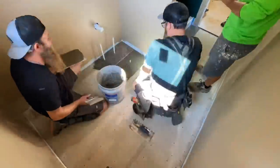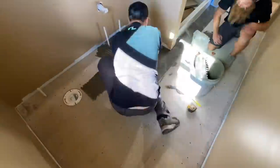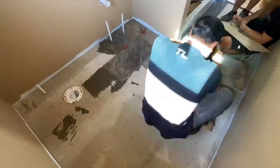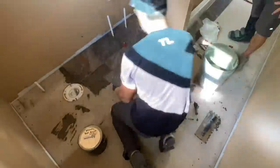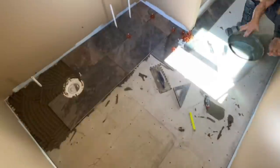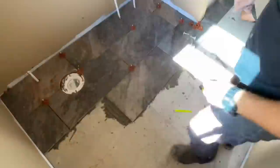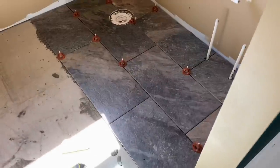You can see I've worked from the door threshold down to the least accessible corner of the bathroom where we'll actually start the tile work. I've snapped a few chalk lines based on the original chalk line from the door threshold to make sure all the tile coming out of the corner is going to end up great once I get back to the threshold. That's just the way you usually have to do it, and that's why I want to point it out.